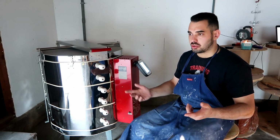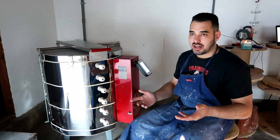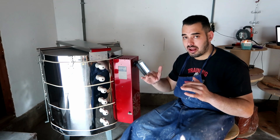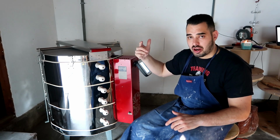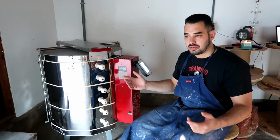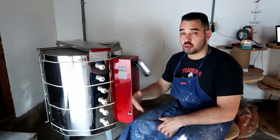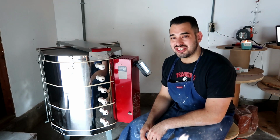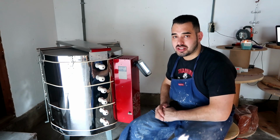But of course, your house already has things hooked up to it. For example, my toaster takes like 6 amps, my washer and dryer take about 30 to 40 amps each, and if my house is only a 100 amp house, well, I can't run something that's 60 amps and my washer and my dryer. That's well over 100 amps. The breakers in my house are gonna freak out and all the electricity is probably just gonna shut off and I'm gonna short out my house. So tip number 2 includes making sure that you have the proper voltage and amps for your house to be able to handle what you wanna put inside of your house.